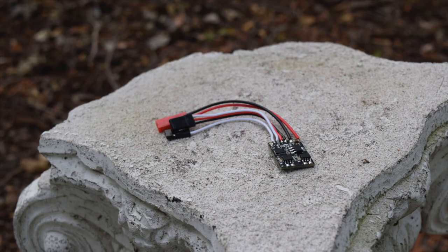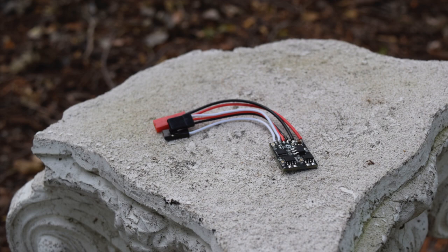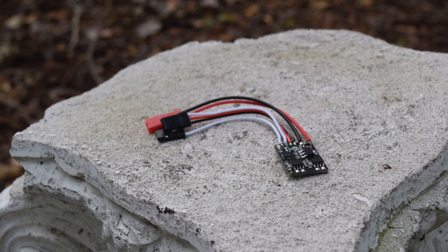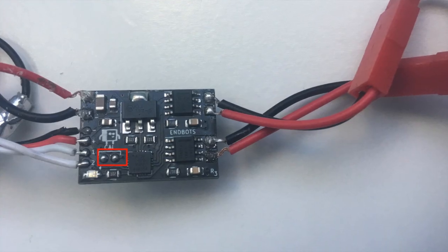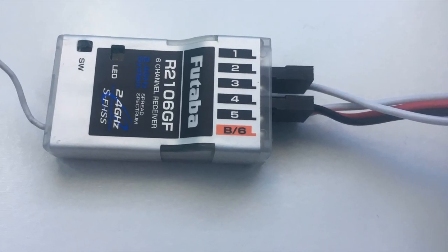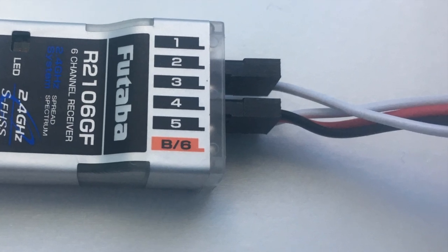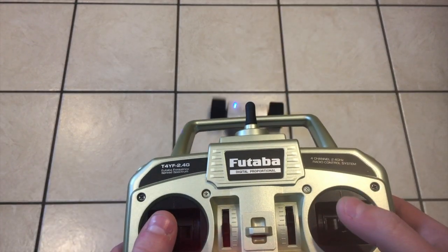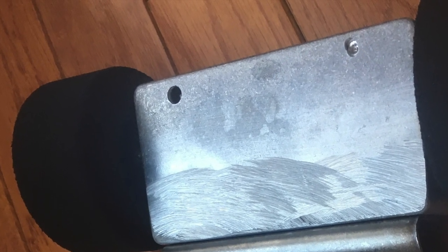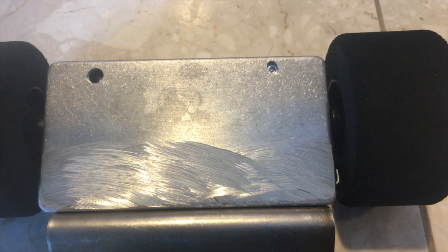For motor control, I use an NBOT standalone ESC, which is super nifty because it provides dual motor control, built-in mixing, and a power supply for your radio receiver. It's super small but packs a punch. When you connect it for the first time, it's set up for tank style controls, which can work, but because I chose a radio that doesn't have a returning left stick, I ended up having to use the mixing. This can be fixed by connecting the ESC to power, connecting it to the radio, and shorting two specific pins. I have the 3-wire connector going to port 4 on the receiver and the 1-wire connector going to port 2, which makes the left stick turning and the right stick throttle. I was originally going to wire in an LED, but decided it wasn't worth the effort and just used the LED on the ESC. There was a huge hole there because I had already drilled it for the LED, but I think it's fine.